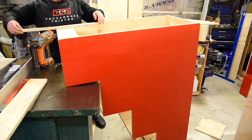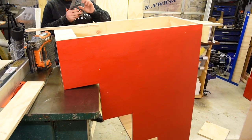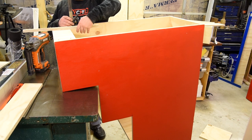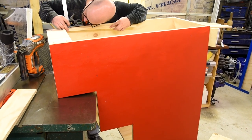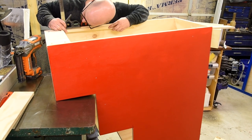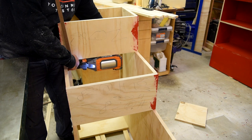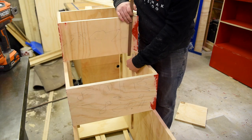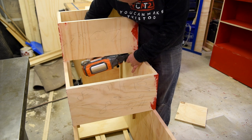The stairs will have drawers inside them, so I needed to add runners to the sides. I'm just using some plywood strips for this. These were a little trickier though — I'll be adding a pad over the stair treads, so the runners need to be spaced slightly above the plywood tread to allow clearance for the drawer so they don't catch on that pad. I just use a piece of eighth-inch hardboard to keep everything consistent as I brad nail the runners into place.